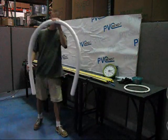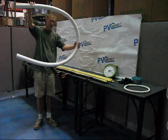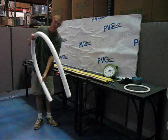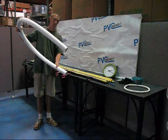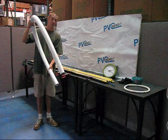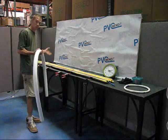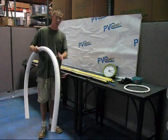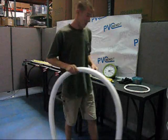When you get up to the nine-footer, this is our ridiculous extreme right here. Take a look at that — that's two-inch schedule 40 PVC pipe and the entire thing is bent. Do that with a heat gun, do that with a cold bend — it's going to be ridiculous, if not impossible. With this bender, you slide the pipe on, wait a few minutes, rotate it as you go, then slip it off and it'll do whatever you ask within its limitations.